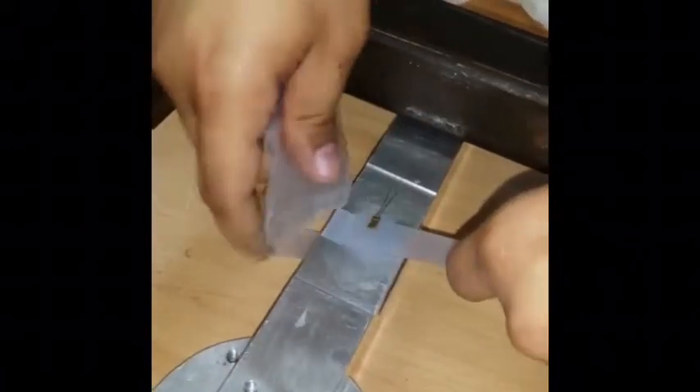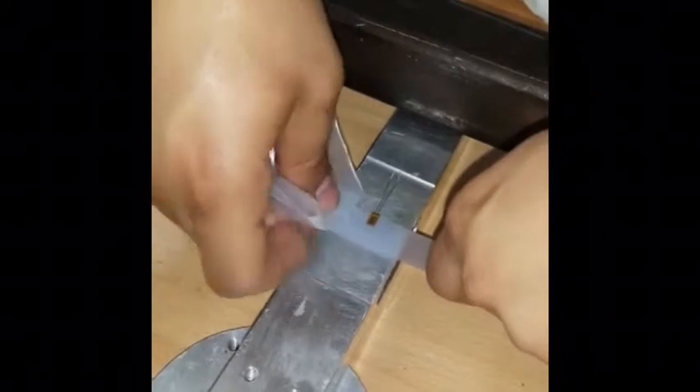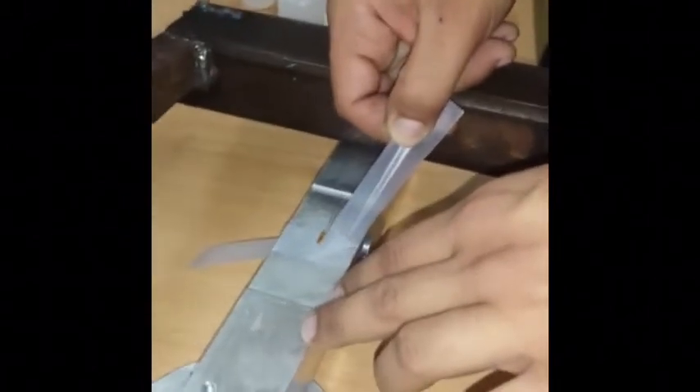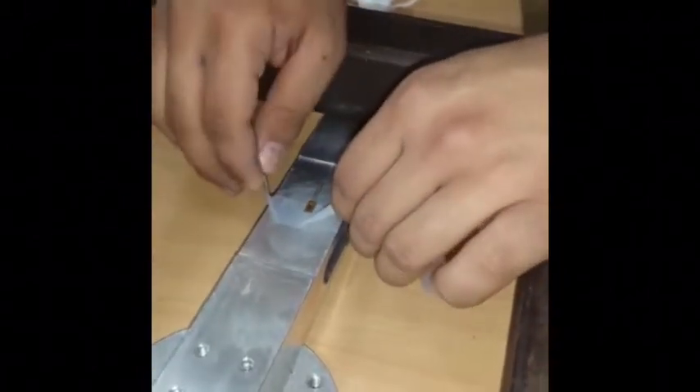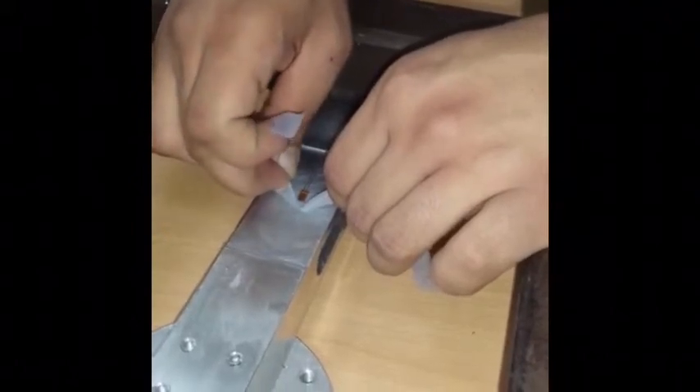After this preparation, glue is applied to the surface of the load cell. The strain gauge was held carefully by tape and precisely installed onto the glue, then left for some time to fix. After that, the same process is repeated for the other strain gauge, and the load cell is then ready to be attached to the body of the scale.